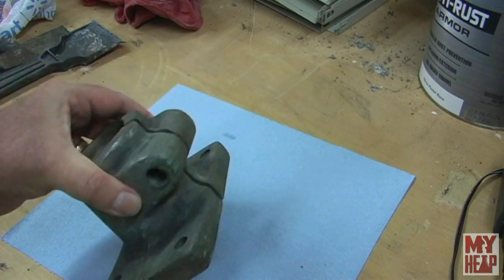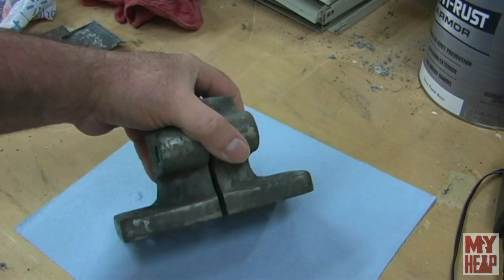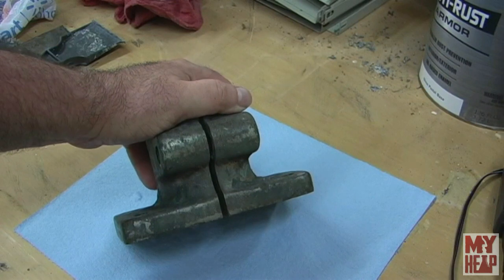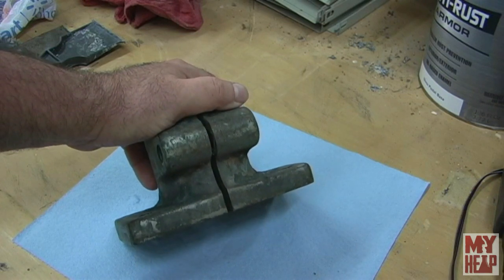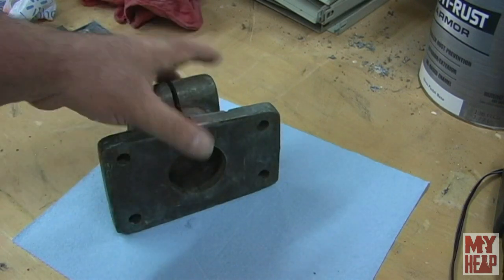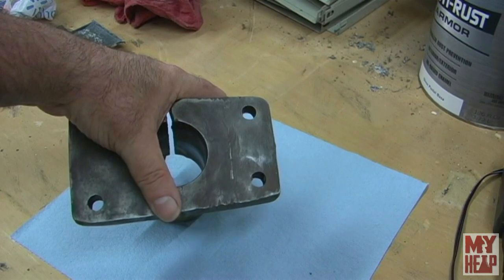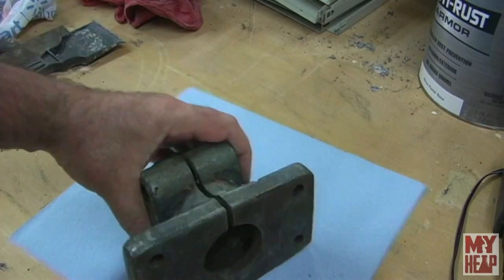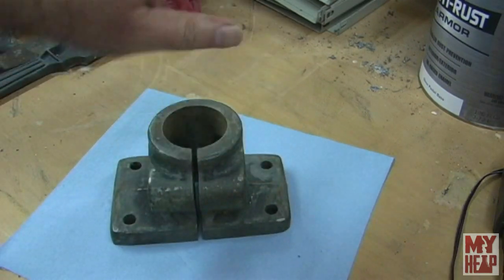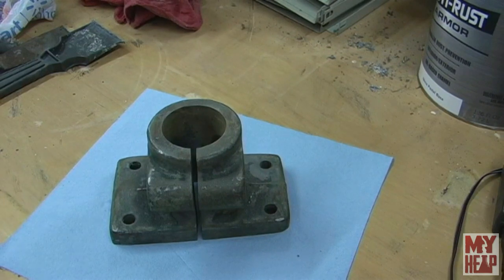This piece here has several coats of paint on it — some black or dark gray that didn't quite strip off. So I'll do the same process as yesterday: lather it back up, put it back in the bag, and come back tomorrow after work. This here is a machined mating surface — I'll leave it plain and probably stick it in the Evaporust to remove any traces of rust, then chase the threads, get it painted, and it'll go on the pile of freshly painted bits.